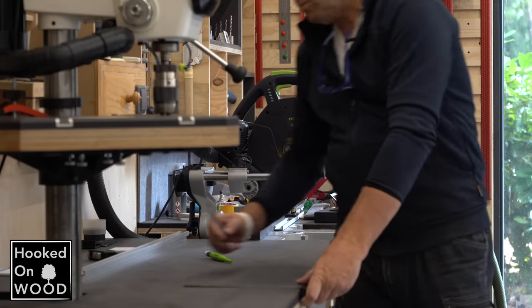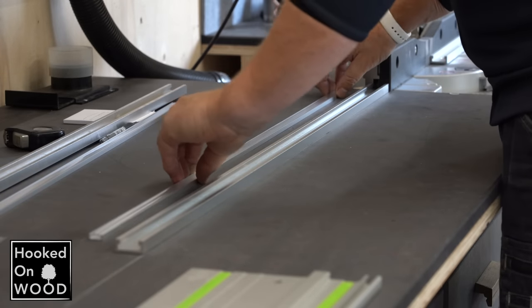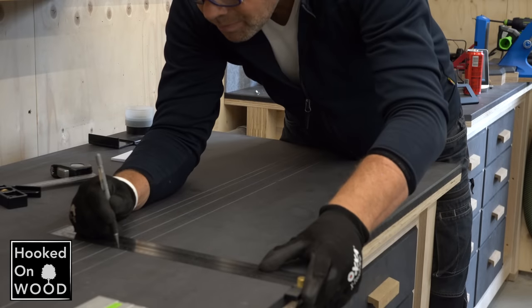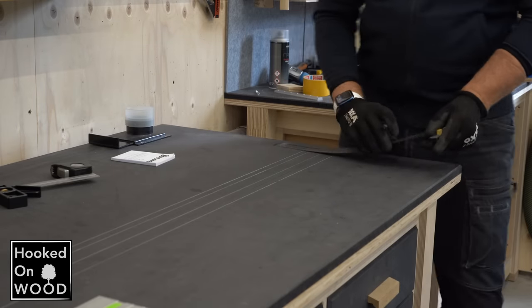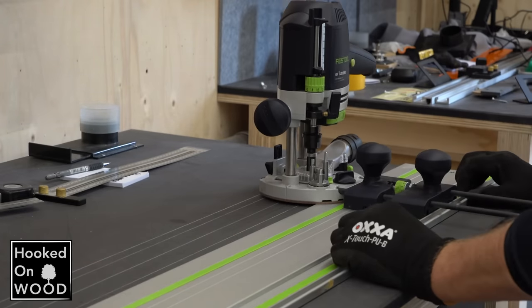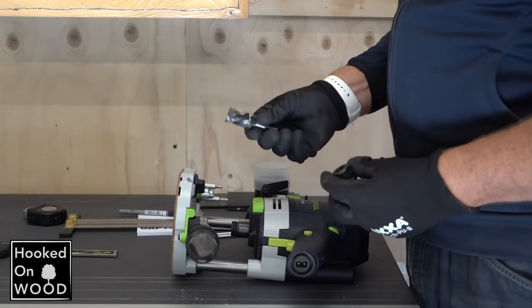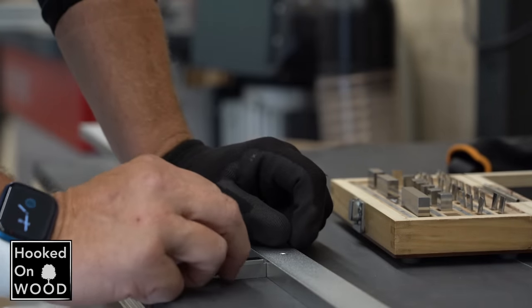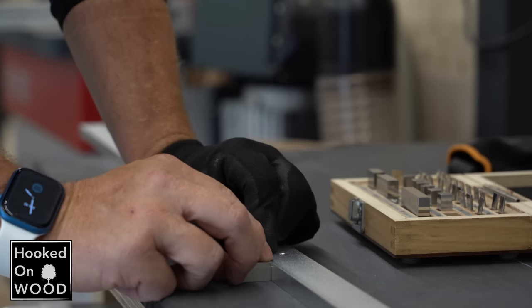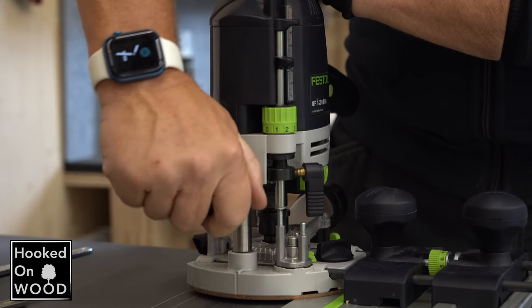The same can be said about the groove I had to make to place my miter track into the workbench top. Making that groove is not that hard, but the preparations and measurements are what it is all about. So I carefully measured where I would place the groove and took my time, because I did not want to screw up my workbench top. I did not want to make more than two passes, so I used my biggest spiral bit. I also mentioned in my former video about my drill press station that a spiral bit is so much more convenient to work with. This big one costs around $60, and although that is a lot of money, they are worth every penny. I used my setup blocks for the depth settings, because I like the groove a bit deeper than the miter track, and it is also much more convenient and secure to do it this way.